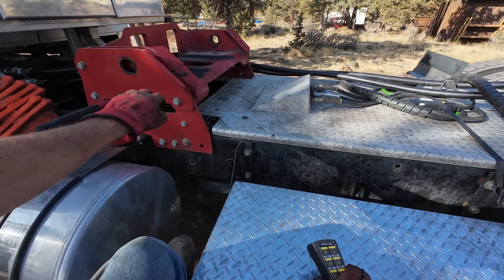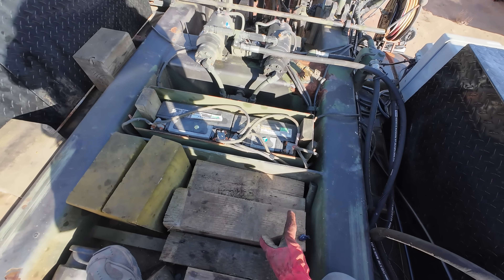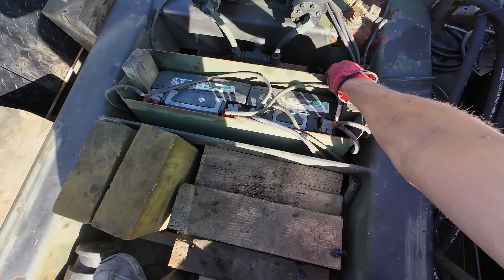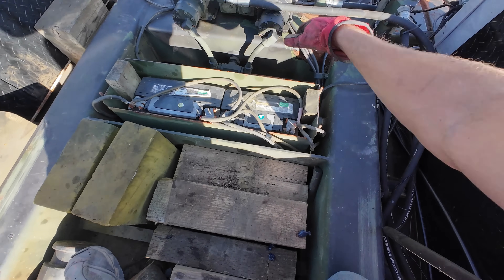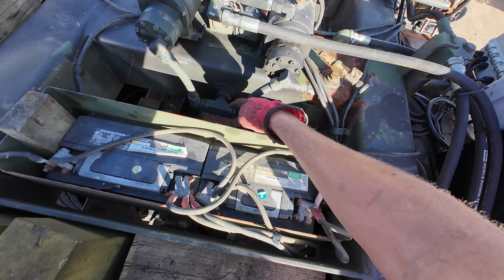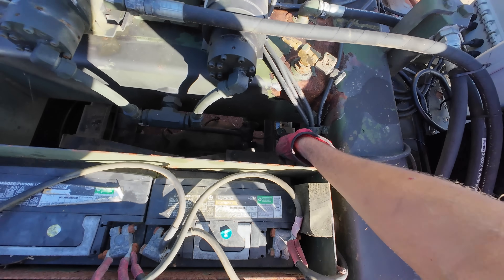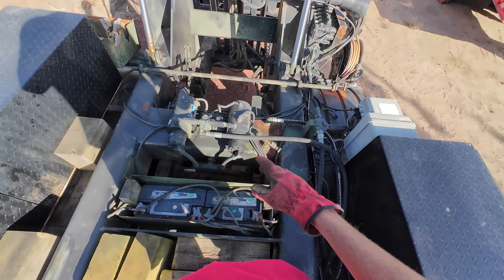What I should show you now that it's unfolded is up here - this is really cool and kind of tricky. Since this unit folds upside down for transport and then does a backwards somersault into itself on the ground using its electric pumps, and then unfolds back out to hook up to a truck - this battery box right here rotates. As this goes that way, the cables all have to go around it, so as it flips over backwards the batteries stay level the entire time. On this cross member is the hydraulic tank - the pumps draw directly out of it. There's a vent on top and a vent on the bottom; the bottom vent is closed right now. When you get this thing 90 degrees upright, you shut that vent and open the top one. As it continues to go over, that becomes the top - pretty clever design.